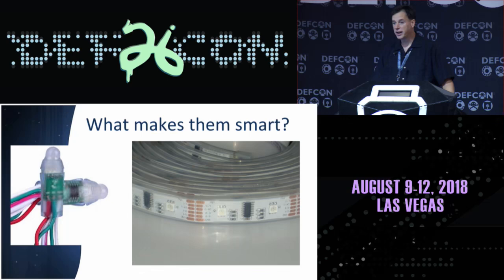So that integrated circuit comes in multiple forms. I have the white strip running down the display. It's also the rolled up reel in the video image. That's a flexible printed circuit card. The chip is separate, and then you can see two LEDs with one controller chip, two white boxes with each controller chip. There's a lot of different form factors. Today, they are starting to integrate the actual LED onto the same substrate as the controller chip.